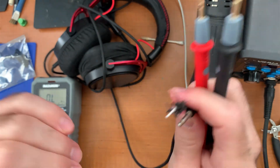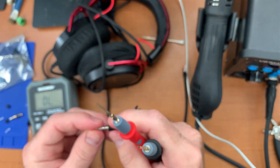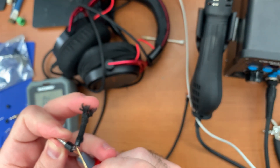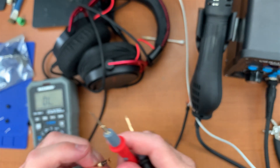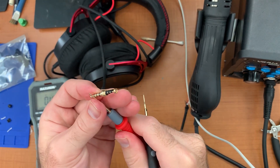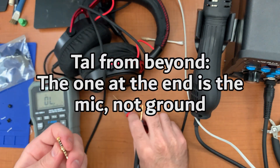Not all headphone developers have the exact same wiring scheme. I've got this on resistance mode — I'm going to put it in so that I can hear a beep indicating there is a clear bridge to ground. The tip, if you recall correctly, that is your left. So let's poke around and find out if we have one that is showing as left. I see copper — nothing showing there. How about that red one? They do have a bit of a coating on them, so this doesn't always work. I'm going to take a guess that this pin right here is the one at the end — and there you have it. The next one down is probably going to be in reverse order, and then the next one, and that last one is obviously going to be ground. So far, so good.